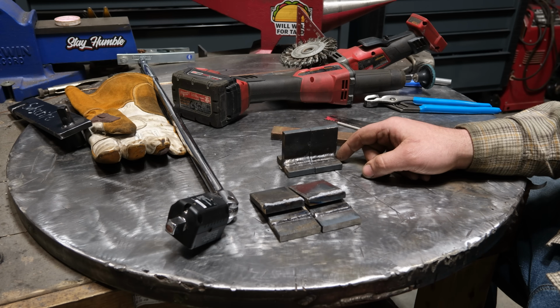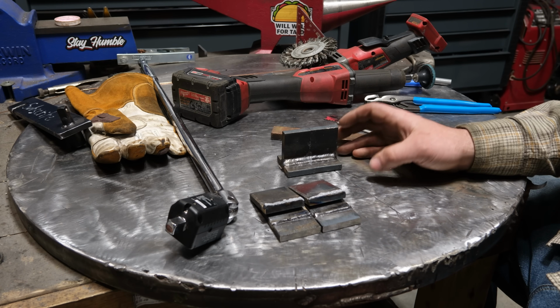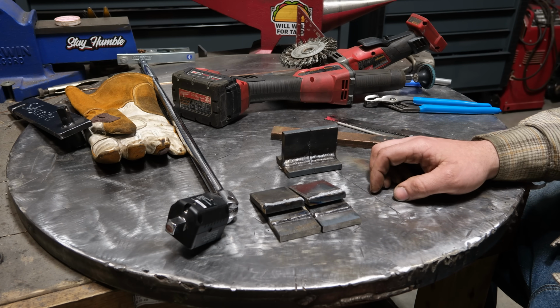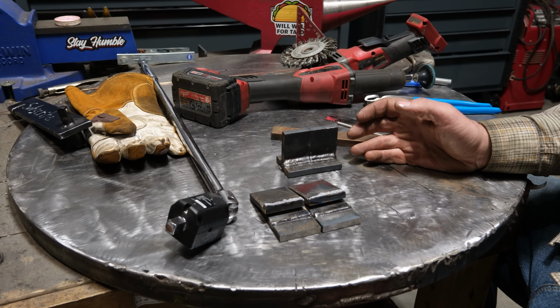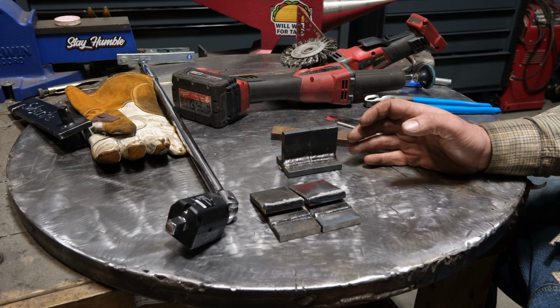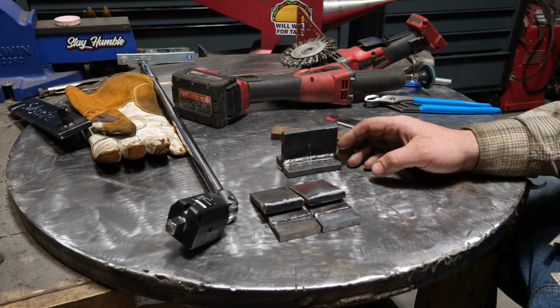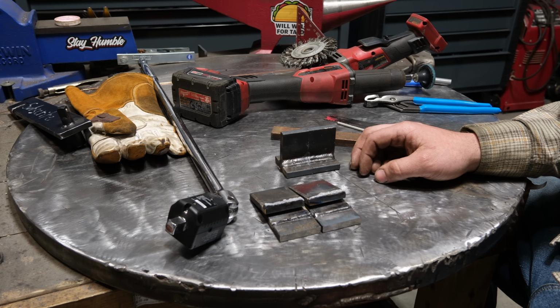Now, if you're going to be welding on known mild steel like what this is, the hydrogen embrittlement issue with 6010 is probably less of a concern. Therefore, doing this with the 6010 root isn't really a bad idea because you're guaranteed to get root penetration, root fusion. It's gonna be there, guaranteed, which is good because that's a good thing to have on thicker steel, especially on scabby stuff. You can burn in there and get it fused.